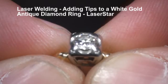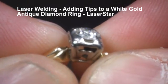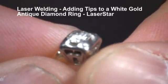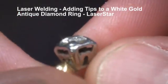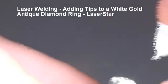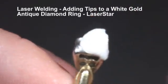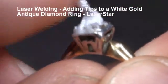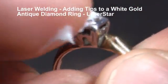Today we're going to be using a 100 joule eye weld to put some white gold tips on a diamond ring. We're using argon gas and I will also be using something to cover this stone just to protect from reflection — we're going to be using a hand cream, just a little dab will do you. Now I have this set up for high speed and we're going to take our 36 gauge wire, that is .005 inch welding wire.